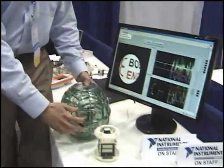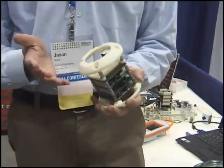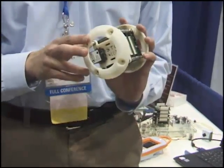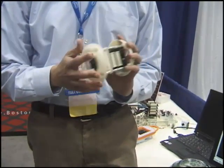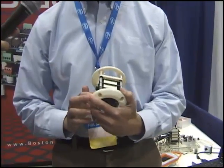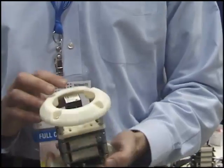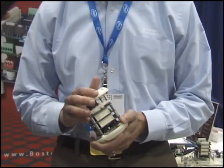And this is the guts of what's inside of the ball here. We're an engineering services firm, so we have electrical, mechanical, controls, and software guys on staff. Our mechanical guys printed this out on our 3D printer, designed in Pro-E, printed it out on our printer, and it went right inside here. And then we've got our FlexStack module here, which has a few of our boards — a power board, the CPU board, and a Bluetooth board, and then a breakout board where you can do anything you want. So we broke it out to an Analog Devices IMU to get us all that rotational data.